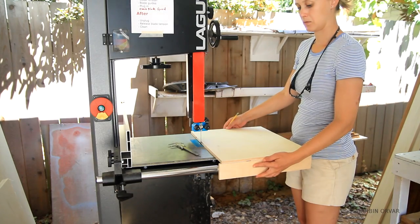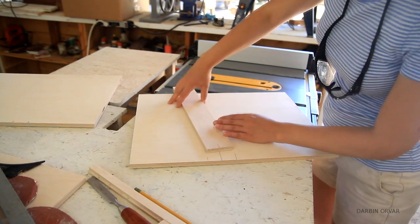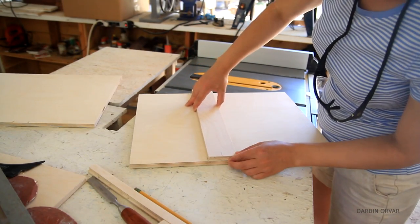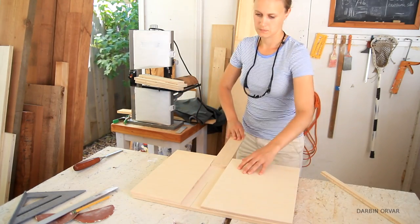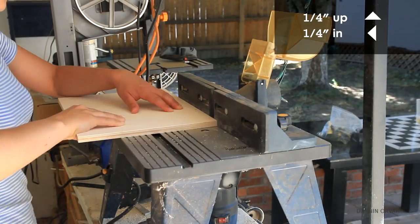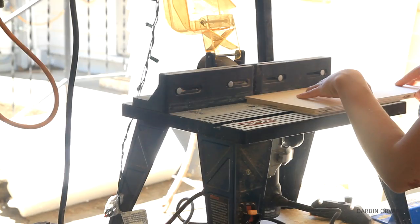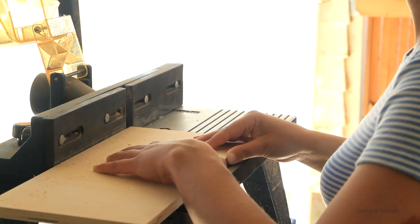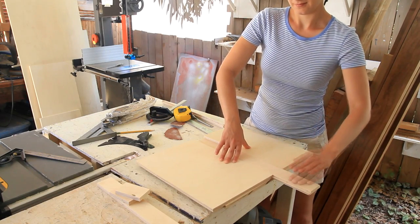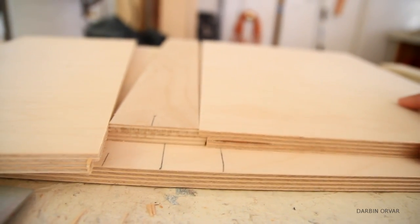Now I'm marking out where on the board the blade is. This is where the sliding track will go, and I marked out the sides of the piece as well on the board. To make a T fit here I'm using the router again and cutting about one quarter inch on the sides of cut B and cut C. You might have to check this and do another shallow pass to make sure everything fits nicely. Try it out with the track slider in the middle, held in place by the T-tracks on both sides.